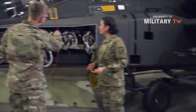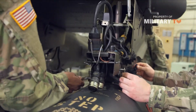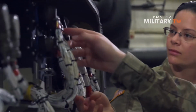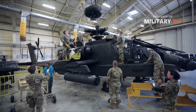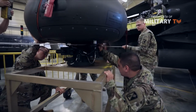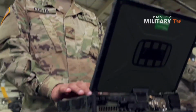The pilot and the gunner both use night vision sensors for night operations. The night vision sensors work on the forward-looking infrared (FLIR) system, which detects the infrared light released by heated objects. The pilot's night vision sensor is attached to a rotating turret on top of the Apache's nose. The gunner's night vision sensor is attached to a separate turret on the underside of the nose. The lower turret also supports a normal video camera and a telescope, which the gunner uses during the day.